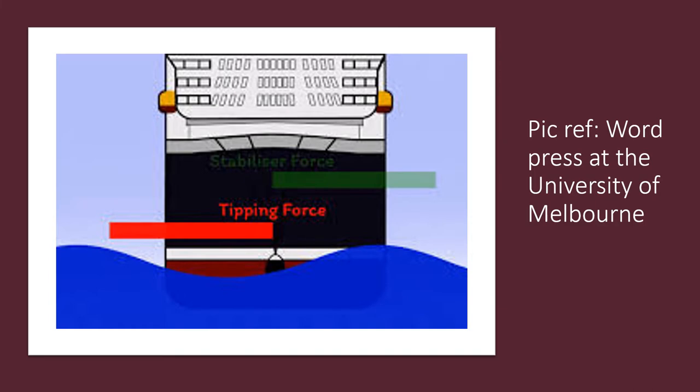The maximal rotation angle is up and down approximately 25 degrees. When having an angle with the water direction, they produce lifting forces similar to a rudder, upwards or downwards. When a ship is rolling, water flows along the sides in an undulating way. The fin is operated such that at any moment a reaction force is produced upward or downward, contrary to the acceleration of the ship's side.